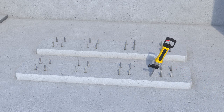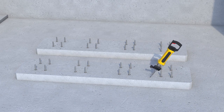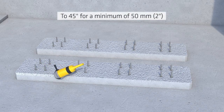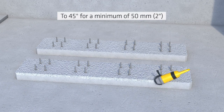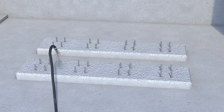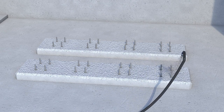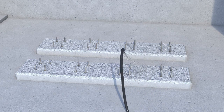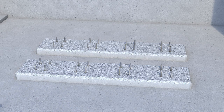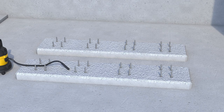Prepare the concrete surfaces mechanically by scabbling, blast cleaning or hand chiseling, etc. Chamfer the edges of the concrete bases to 45 degrees for a minimum of 50 millimetres or 2 inches by grinding. Any loose or friable material must be removed, best by blast cleaning to achieve a contaminant-free open-textured concrete surface. Finally, vacuum the surface so that it's also completely dust free.